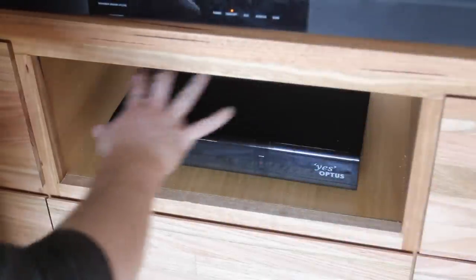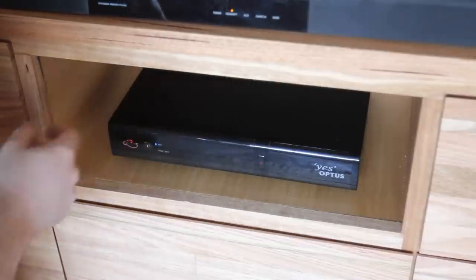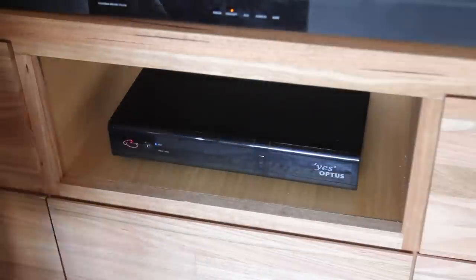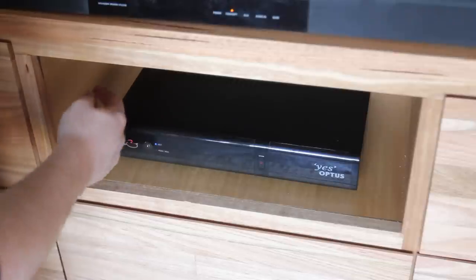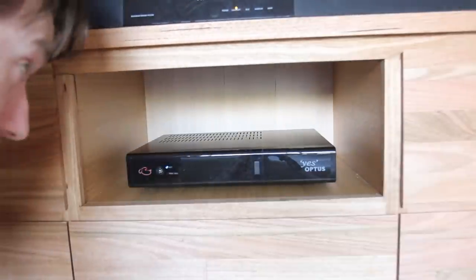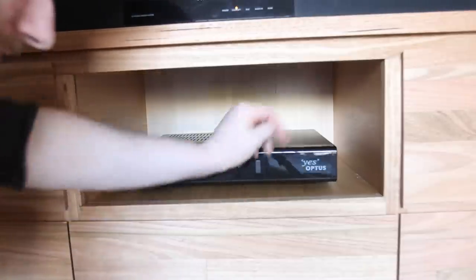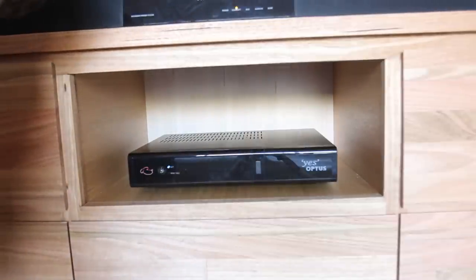The set top box is the only device that mum needs other than the sound bar, so there's just the one cavity for a relatively small device. There's a piece of MDF shelf that sits in there on two cleats front and back. Two side panels of veneered MDF — the same stuff used for the other side panels — are screwed in from the back where the rails for the drawer slides go. The back panel was forgotten about until today so it doesn't have a finish on it at the moment. The cables go through the semicircle I made earlier in the shelf piece so all cables are invisible because the device itself hides them.